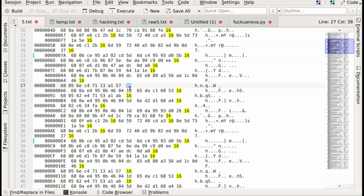So that made sense. The next thing that I noticed was the second byte in looks very uniform. It looks a lot like a command. I mean, if I was to write a packet, it would probably contain a command and then some data and then a checksum, right? That's just standard. So seeing how uniform they are and how repeatable they are and how close together they are, it makes sense that that would be a command. And so that was my first assumption.